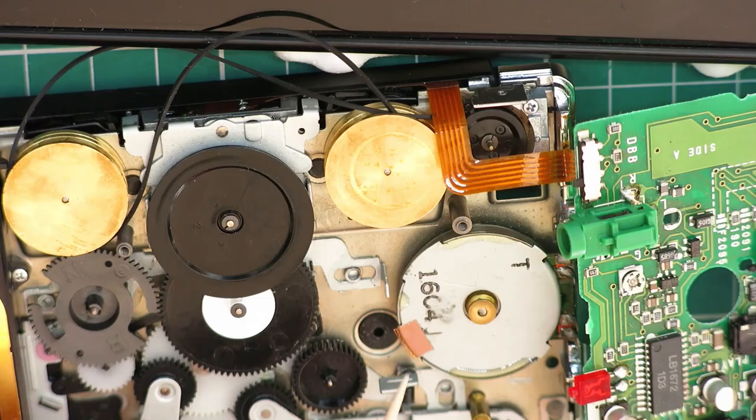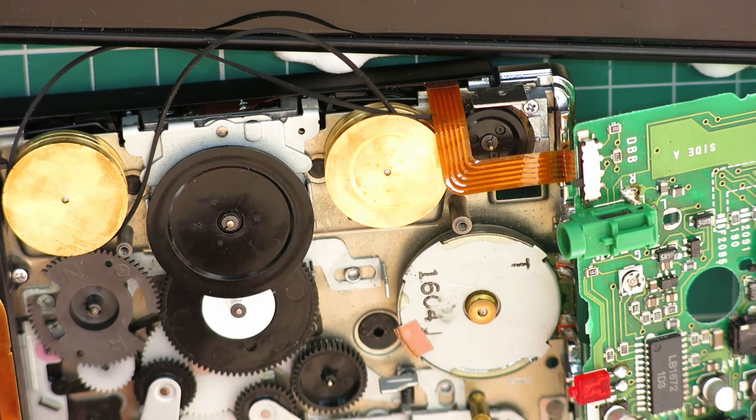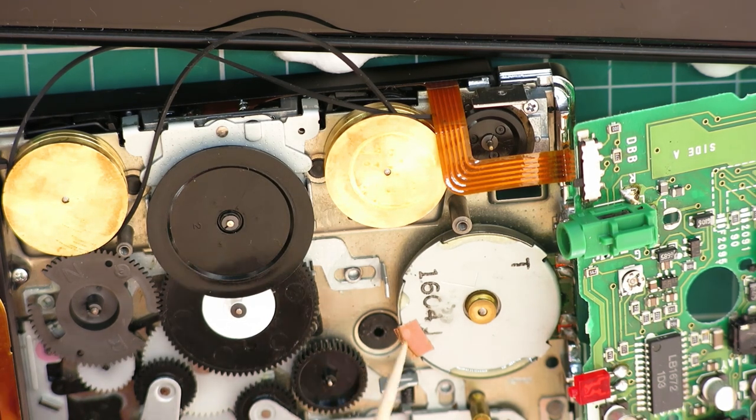Bugger. I managed to do it. This hole here is where it was. And I had to drip a little bit of acetone through a thin tube at the other side. Well, at both sides really, to just try and get it to wick through. And then I managed to push on it and it gave way and it went through, and it looks like this is fine. Again, I believe this to be Delrin, which is acetone safe. If this was ABS, we'd be in trouble.